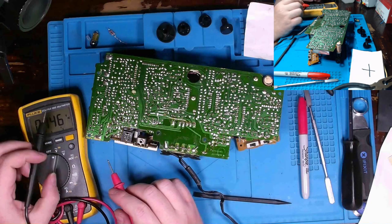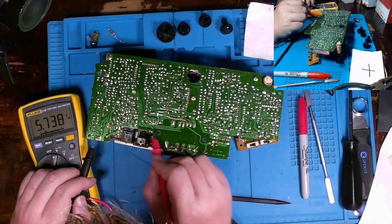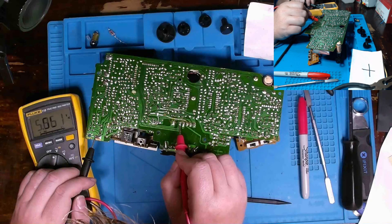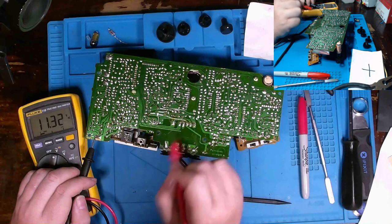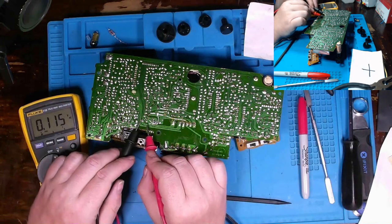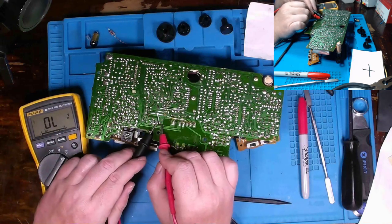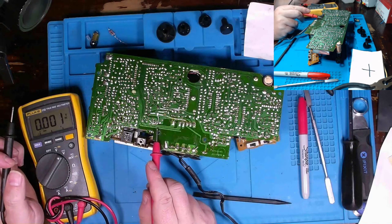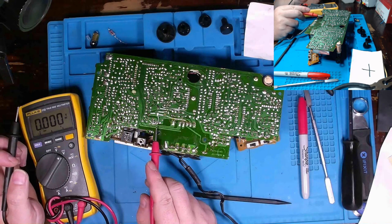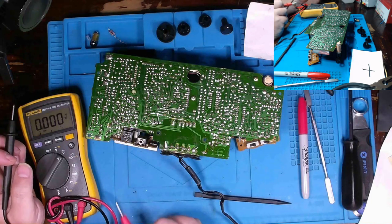That's the other 322. This comes off of that leg and this one that leg, so it's basically a filter cap across the line essentially. So yeah, 4 volt difference. No DC component across it. I'm gonna work off the assumption that we're probably about 50 VDC, 25 VAC, concerning those disc capacitors.